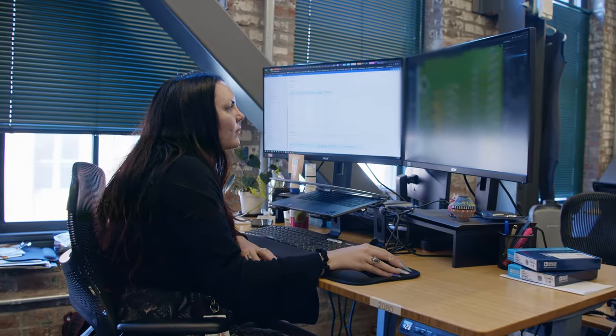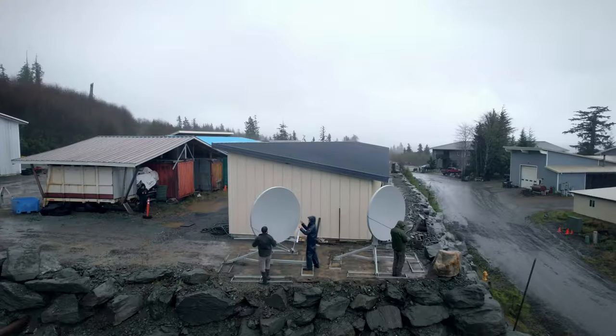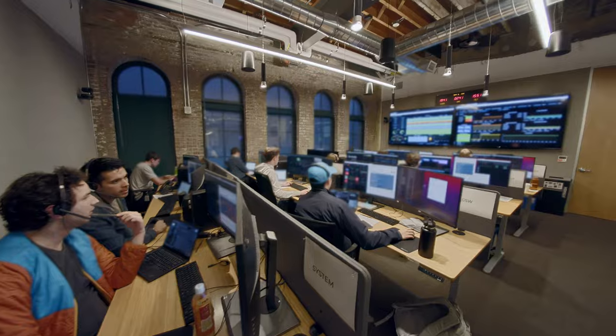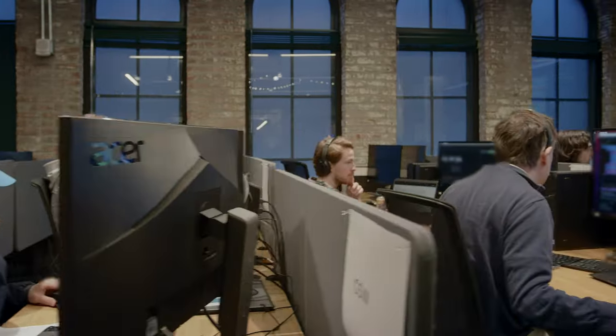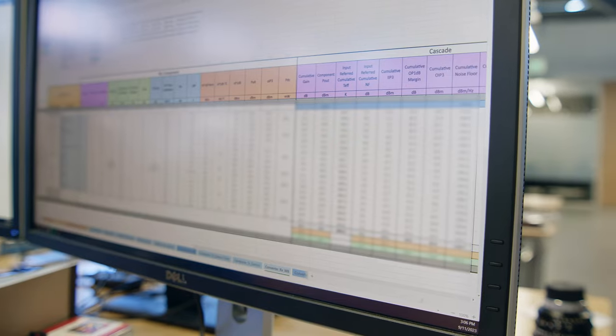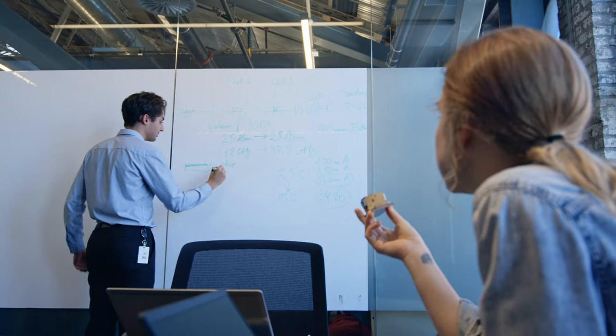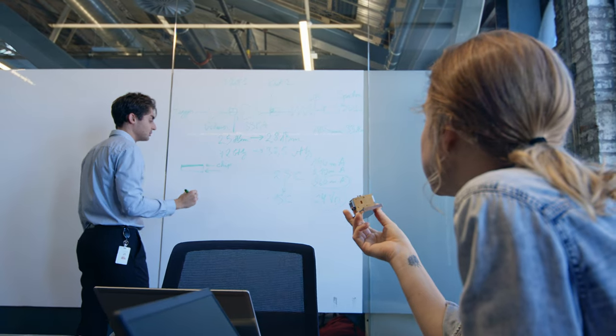The whole systems team ends up trying to simulate the performance of the whole satellite link — from the ground to the spacecraft and back to the ground. We do that through computer simulations, but you can also approximate a lot of things with spreadsheets, adding some margin on top or being a little conservative, while being more aggressive where it counts. There are a lot of approaches to modeling the whole end-to-end link, and that's ultimately what we care about because that's what the customer cares about.